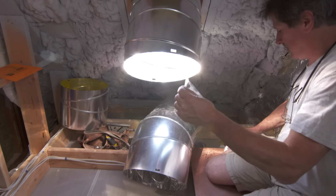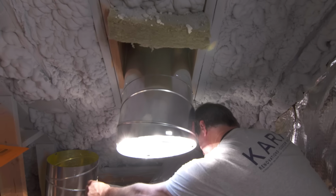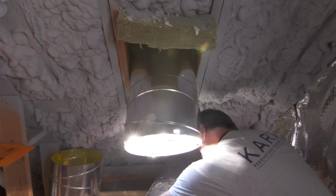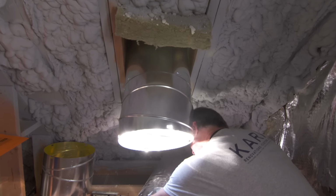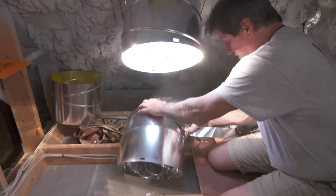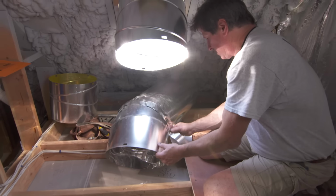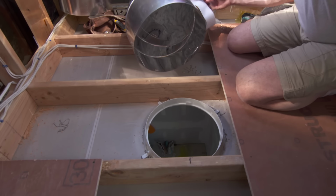Yeah, so what we chose is a 14-inch skylight that is designed to go in between 16-inch on-center framing, which is a normal framing practice. Chose it so, they've got other sizes, bigger, smaller? Correct. Okay. And so there's the roof angle, 45 degrees or so, and then we've got to come down to the flat ceiling of the closet. We've got to make that turn.